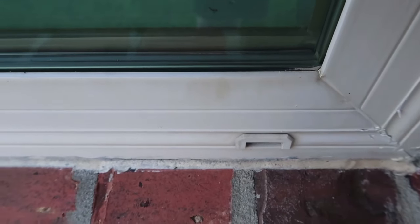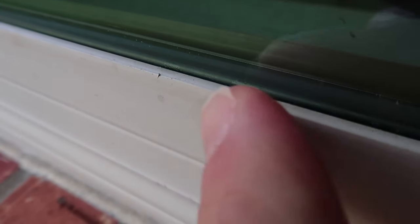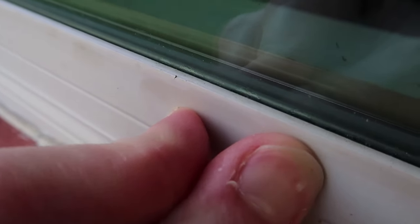If you look at the bottom of this one, you can't really see anything weird going on — there's no obvious problems or visual issues that will let you know where the seal failed, but with a little bit of work you can figure it out. In my case the moisture looked like it was towards the bottom of the window, so I went outside and checked the bottom of the window frame. Sure enough, pressing on the bottom of the frame I started finding bubbles — there was actually water and a lot of moisture trapped down inside the window frame. The first step is finding the source of the moisture.